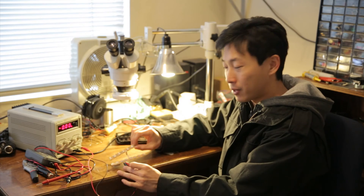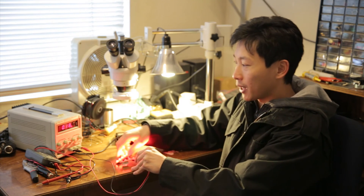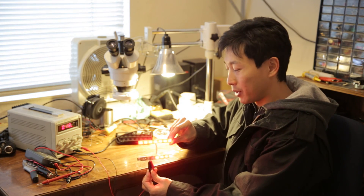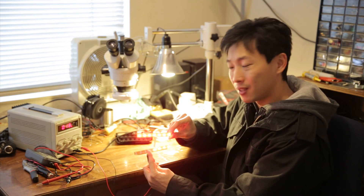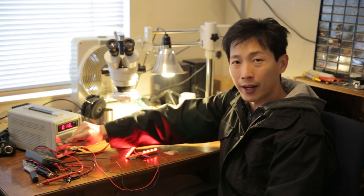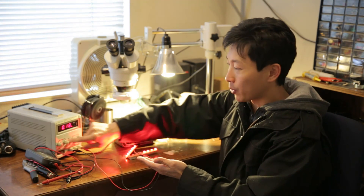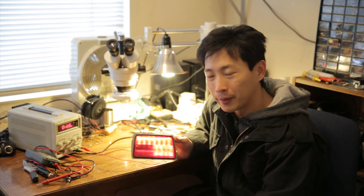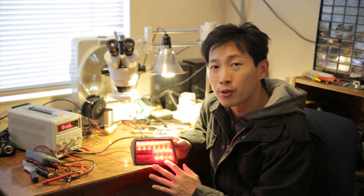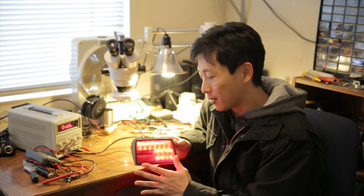Here are the LED modules connected to the 12-volt power supply. When I turn up the current it goes to roughly 180 milliamps, and you can see only 11 of them are lit up because I had to jumper across the ones that are completely shot. The important thing to know is that even if I increase the current on the power supply, it's not going to increase the current through the LEDs — it just wants 180 milliamps. With the module put back in, some of them aren't lit up, but at least it lights up. I did try to find a replacement module and spent maybe half an hour to an hour looking, and couldn't find one — that's why I'm repairing this one. Having it lit at least three-quarters of the way is better than none.